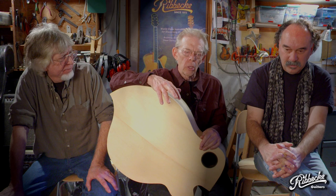And that's when guys like Owsley Stanley, who worked on my, and gave me ideas for my first conversion of the Starfire bass. We started talking about things like what Les Paul used to do, which is convert everything over to low impedance, which gave you a broader spectrum of sound. You heard more harmonics. It wasn't as loud as high impedance, which is kind of almost like squashing the sound like a compressor does and puts it out more in front of you. But that's what you have an amplifier for.